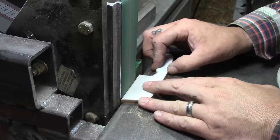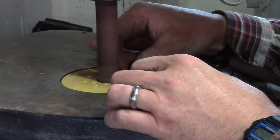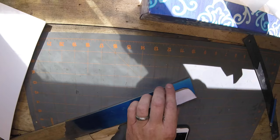After I'm done getting it all roughed out on the bandsaw, I'll take it to the belt grinder — that's my homemade belt grinder. I use it for most of my wood and handle work, and we'll do a lot of profiling. I'll also use my oscillating spindle sander. We're going to use O1 tool steel for this knife, 3/16" thick by 2 inches.